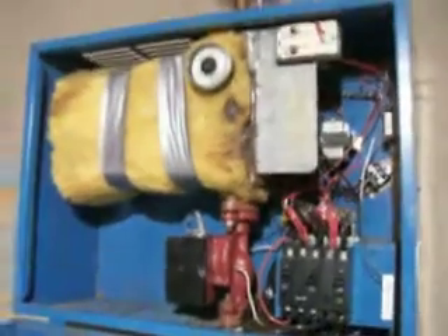We've got cheap electric here — hydroelectric power. I had an electric boiler, but it was too big because it was drawing almost 100 amps. It's got four 5,000-watt elements, which is about 80 amps or so. Too big. So I'm putting in this new high-tech electronic one.